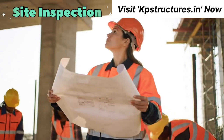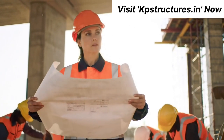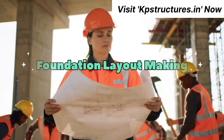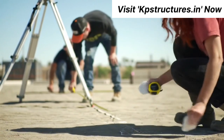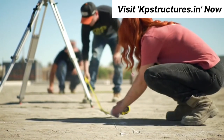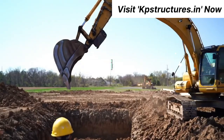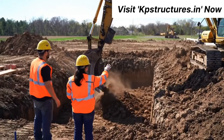The foundation process begins with a site inspection, where engineers assess the land and review construction plans to ensure safety and accuracy. Once the site is approved, workers mark the layout of the foundation using measuring tapes, chalk lines, and leveling tools for precision. Excavation is then carried out using heavy machinery to dig trenches for the foundation as per the marked layout.